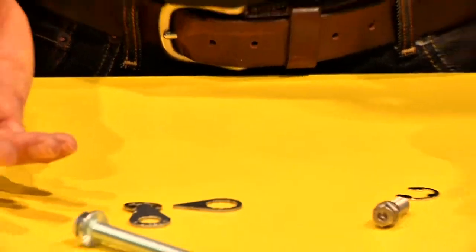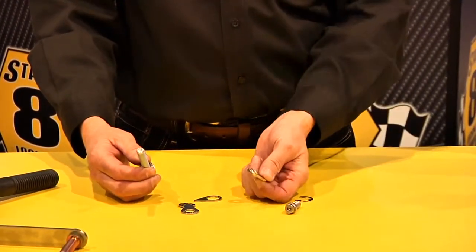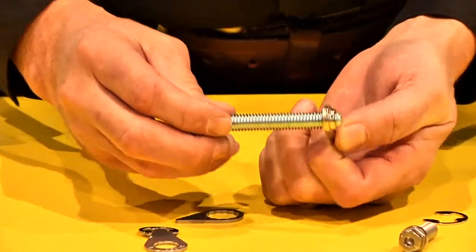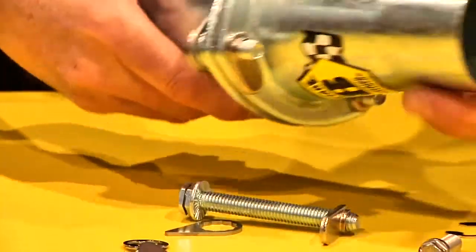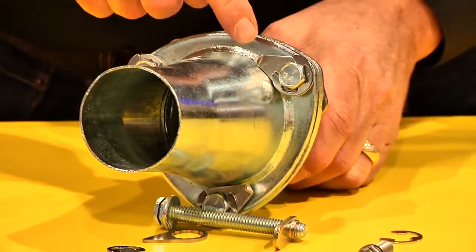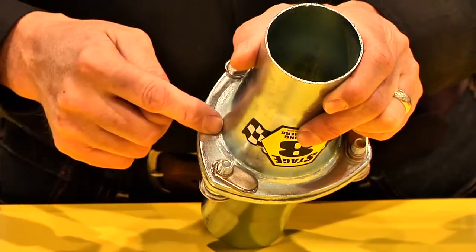The next step up in complexity is for a collector kit. We add one extra piece of hardware called a threaded tab. The threaded tab goes on the back of the collector bolt. The tab will spin around and hit the tube on the back, so you only have to wrench one side. Once installed, the bolt cannot counter-rotate because the retainer is up against the tube, and on the back side the threaded tab can only tighten itself.